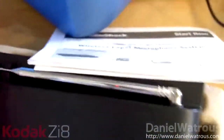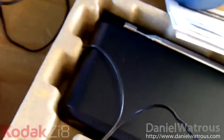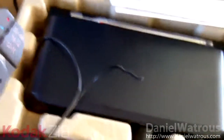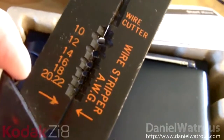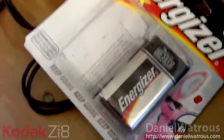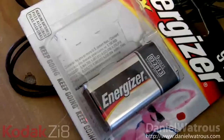What I did is I took my basic wire cutters — you can get these just about anywhere — cut the end off, and now I'm going to splice the ends off. I'll probably use the smallest 22-gauge wire here. I'm going to try connecting a 9-volt battery first, just using roach clips so I don't even have to do any soldering. I'll see if it powers up and how long it takes to drain that 9-volt battery.